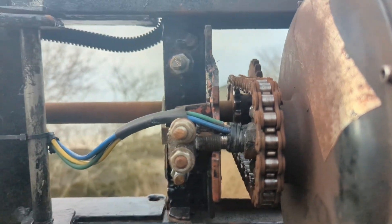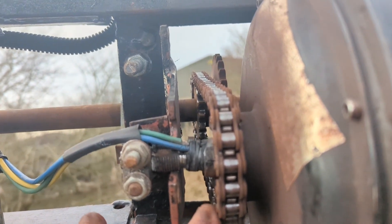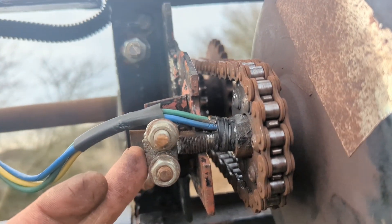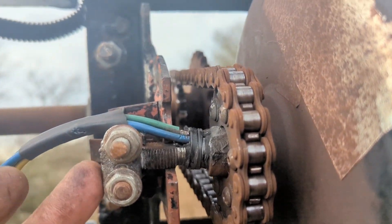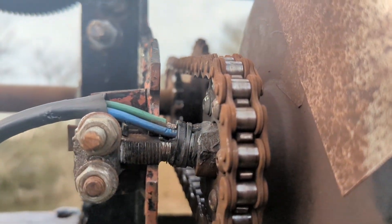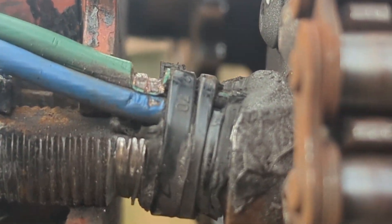Just a quick one for anyone who's interested — the turbine had come down because I noticed the chain had come off. What had happened is these bolts here had been done up with a drill rather than by hand, so this whole thing had just fallen out. The consequence of that is that the chain had been rubbing on the cables, particularly the green one.